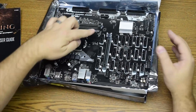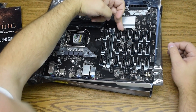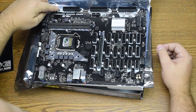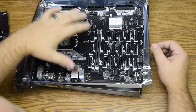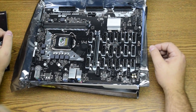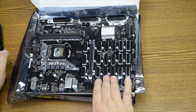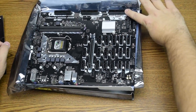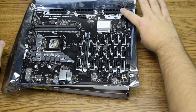Looking at the board itself: the first seven slots, labeled set A, require power supply A connected here. If you're only mining with seven cards, this is the only power supply you need. Sets B and C require power supplies connected here and here, which will power the additional GPU cards.